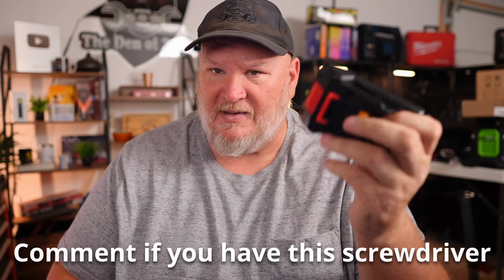What are you going to use it for? If you're going to use it on your core tools, that's the main thing. It's going to be impact wrenches, drills, impact drivers, your circ saw. Not the best choice. And the reason is, and I hate to say it, these adapters are just plastic with metal connectors. Not a ton of brains in this box, all right? So what you're getting, though, is a direct connection to the batteries. What you're not getting is that smart interface between the battery and the tool.